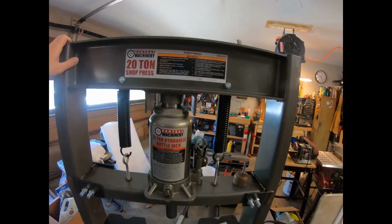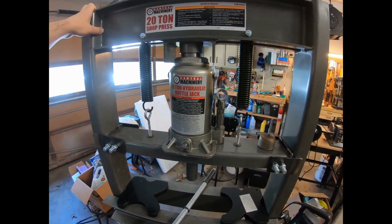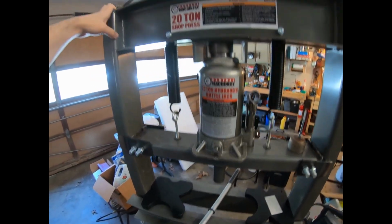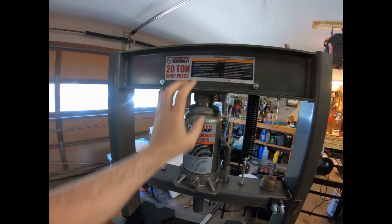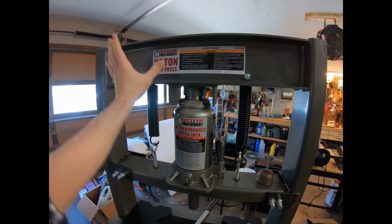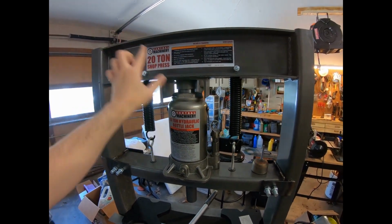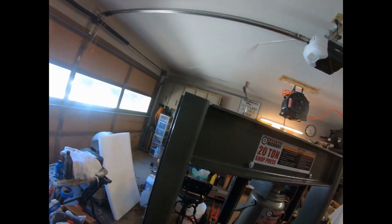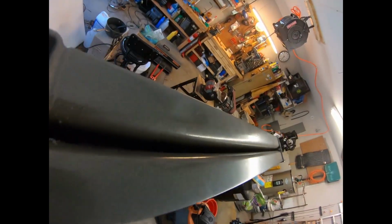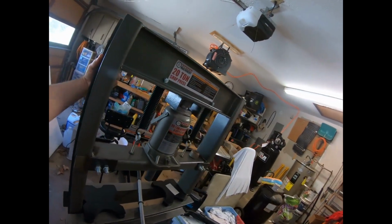This is not I-beam. I've seen some pictures on the internet where, on certain ones, maybe they got a defective item or what, but this centerpiece, because of the force of the press, has bent upward, and it's distorted this whole midsection. And that's partially because you have a big gap right here. It's a weak point, plain and simple.